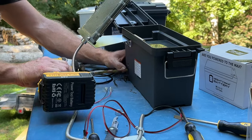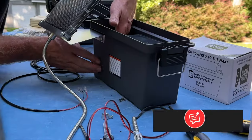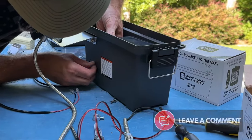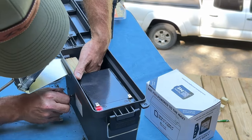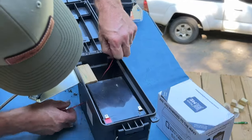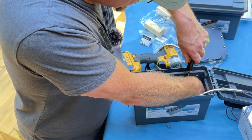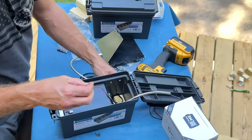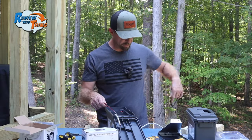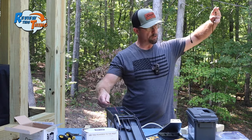I used a 3/8-inch drill bit and a 5/16-inch drill bit. Now I'm going to clean up the edges of that, mainly just so the caulk will actually stick to it. And now we're going to try to feed this wire in there. Perfect. While I've got that off, I'm going to go ahead and feed these in there. I'm going to leave a bunch of this wire outside the box because this is the wire that goes to the camera.